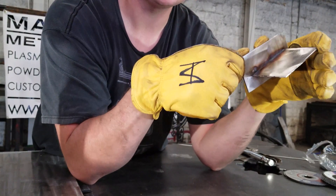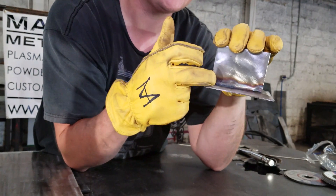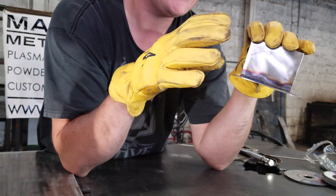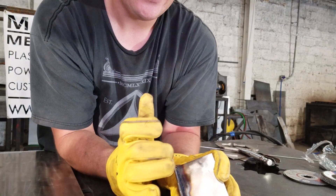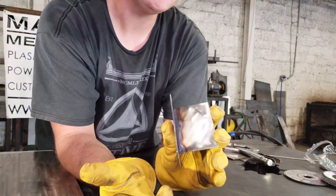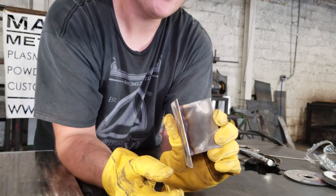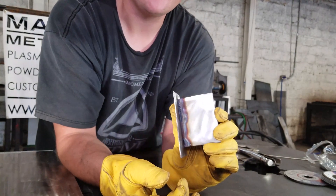The stainless characteristics of the metal is what changes when you get the sugar. If you build up too much heat on the back of your weld and you start seeing these kinds of marks, that means the metal actually got so hot that it could react again with the oxygen in the air. That oxide is basically the same thing as rust. The biggest reason you use stainless steel is because it doesn't rust — but if you add this sugar on the back, you're going to have rust right there. So that's something to watch out for, and that's why we really need to add some filler metal and get within our parameters.